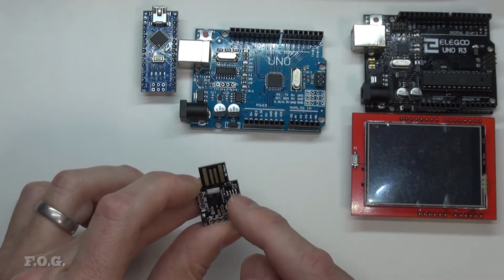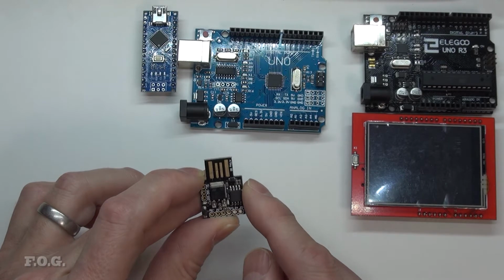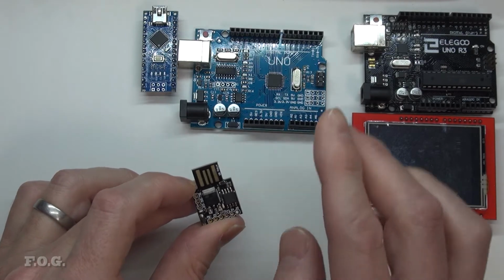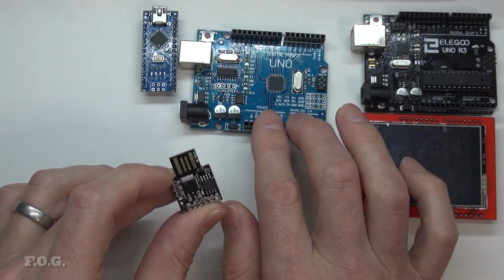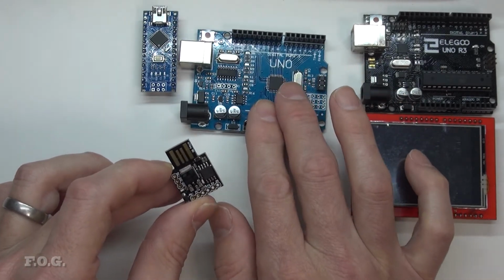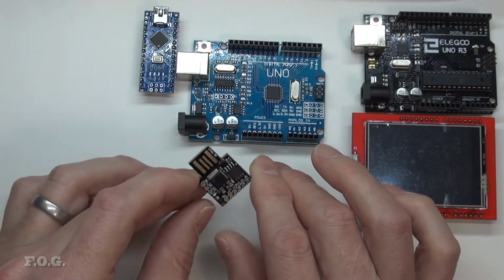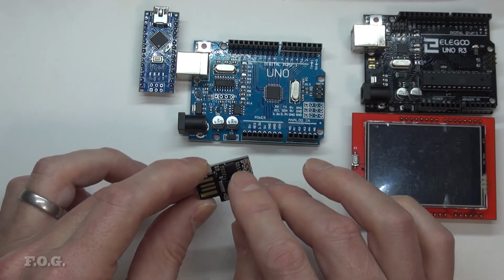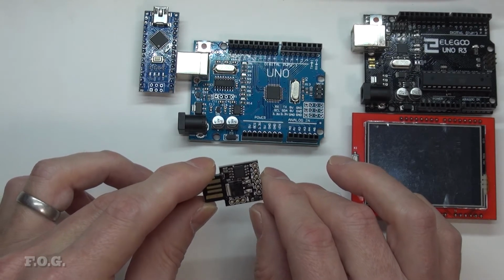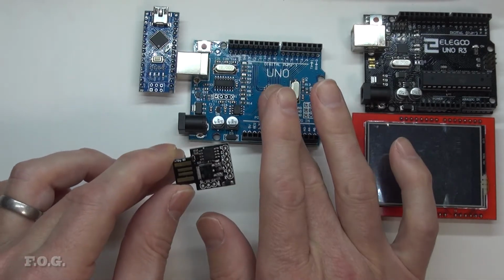So you actually have a much bigger, effectively, demand on the bootloader, in a sense. And given that you have a lot less ROM to deal with, it's more of a burden. In the Uno case, I believe I saw it's around about 512 bytes for the bootloader that's on here, and that's because obviously it's not having to behave as a USB host. But for this one here, I believe it's around about 2K out of the 8K is consumed by the bootloader, and that's a lot, and that's a huge burden actually. And the behavior is nowhere near as good as the Uno.